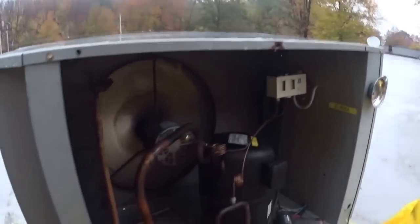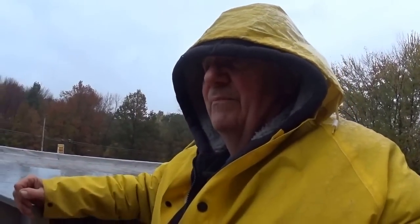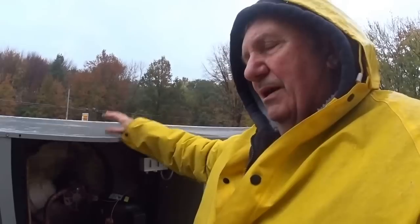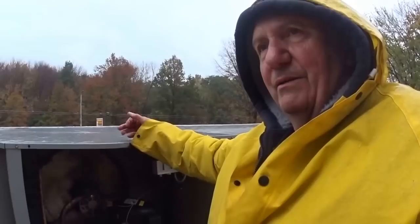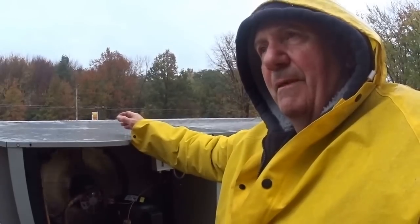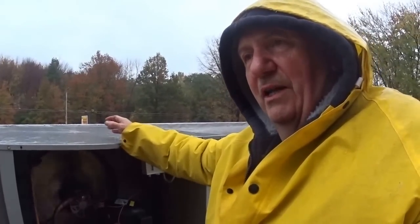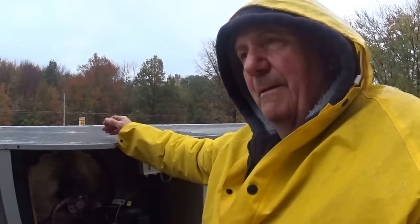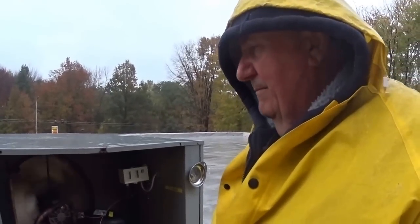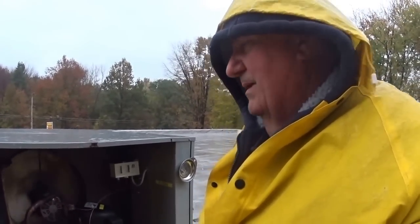A little wet and soggy one today, but we got that job done. We moved the cooler, took the compressor off the roof, moved it over here, put it on the roof with the elevator. Put the box together — it was a difficult one. It originally started out six foot wide; we had to convert it to eight foot wide, and it was originally an L-shape but we converted it into a straight one. I just adjusted the expansion valves — one valve had a TD that was minus, way off, probably hadn't been adjusted in years. But it's doing good now. Okay folks, hasta la vista.